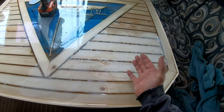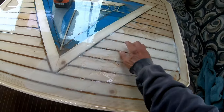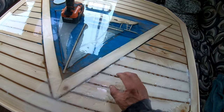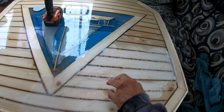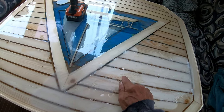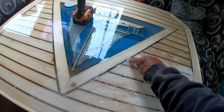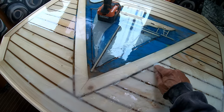It's not eliminating the bubbles. They are starting to get trapped inside the resin. I let that go, and I had craters — not craters, but volcanoes — all over the place, where the bubble got trapped underneath and just pushed up the epoxy to the top. I had a quarter inch raises all through here, plus those tiny bubbles, more exaggerated on this area. And that's what you see here and in this area over here.